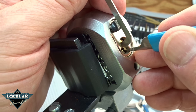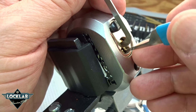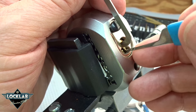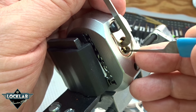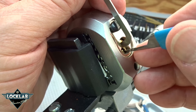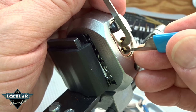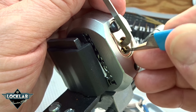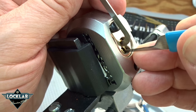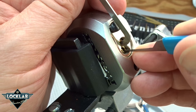I just touched six and got a very slight click. My tendency would be to push with my thumb to check, but if you do that you're going to lock up the cylinder. I just clicked three — we've got serrations here for sure. Looking for some counter rotation... there it is, right there — four.